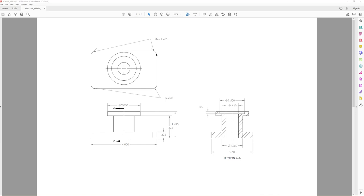The last feature we'll be going over in this lesson is the chamfer command. We've got it in two different places. Looking at the top view, we're going to want it on the top left corner and top right corner. This chamfer is going to be 3/8 of an inch by 45 degrees. So with that, let's get started — we'll start with a 4-inch by 2.5-inch rectangle on the top plane.